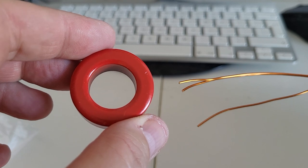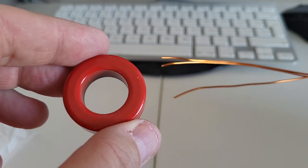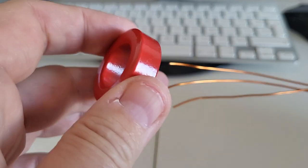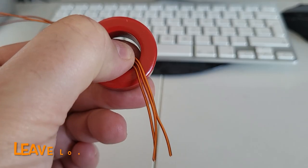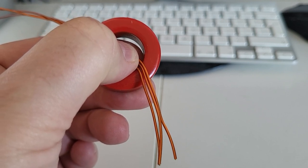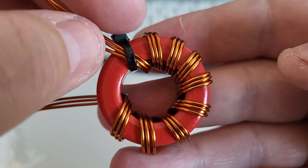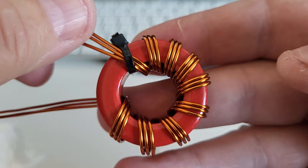For the next part, the T-106-2 unun, I need three lengths of about 20 inches (55 centimeters) of copper enamel wire. Colored wire is nice because you won't make mistakes when connecting. I have to keep them in the same order throughout the winding — that is nine turns. You can see they're not all bunched up together; they are three by three. Make sure you don't cross one wire over another — they have to stay in the same order.